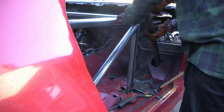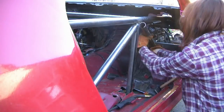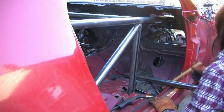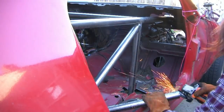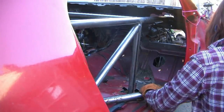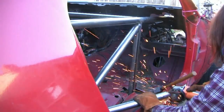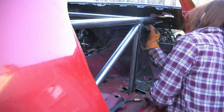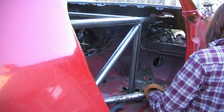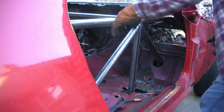I'm going to try to tie in to where the subframe just starts its bend. The subframe is flat going forward and then it curves down and goes under where the passenger seat was. It's kind of a weak point and I'm trying to keep that from rotating in a collision and bending there. More complicated fitting here, a couple pipes coming together.